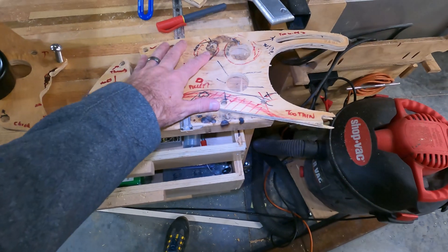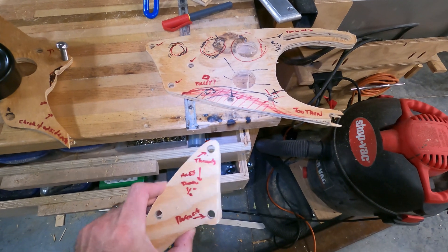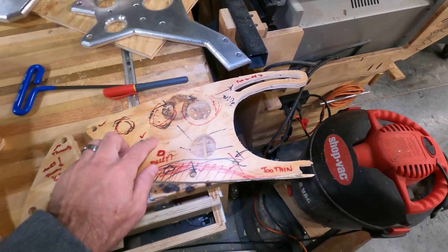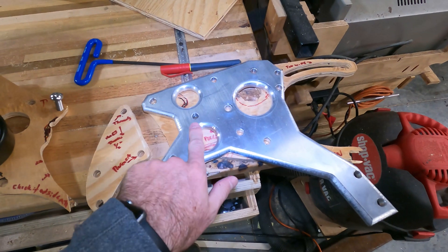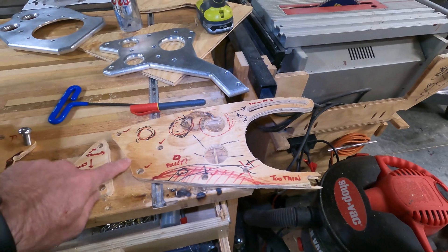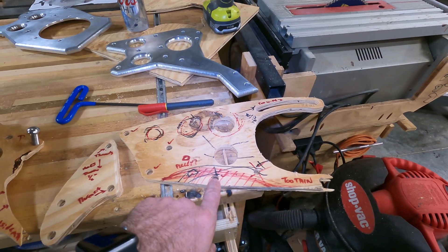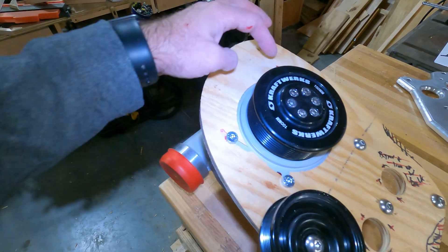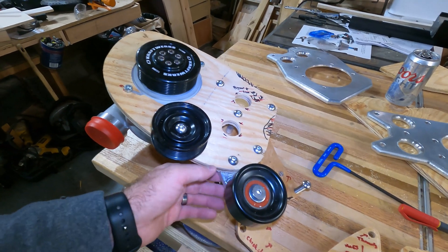These two comprise the driver's side — this is the power steering pump bracket and this is the alternator bracket. When I'm done machining these with the Shapeoko, I'll put them in my router and do a chamfer. I need to make an organic kind of swoop through here, and that means I might lose these little notches, so they need to be moved over just a tiny bit — maybe a tenth of an inch. I think where the pulleys are is just about perfect.